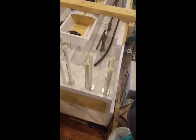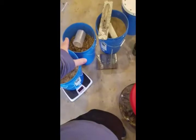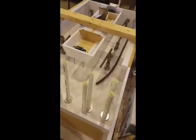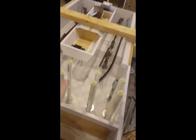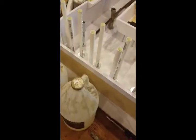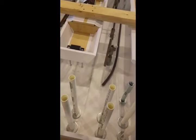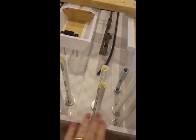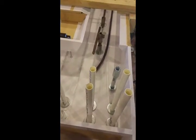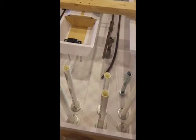This particular casting is 182 kilograms in total, based on how many of those small containers of gravel it will take to fill this particular mold. Now, I'm not filling this mold all the way to the top — there's a little divot in the middle where a ball screw rests. I've got some tapers on the side, some pipe that's going to displace some of the media, and some internal reinforcements and studs. But it's better to know what it would take to fill it entirely, so you have too much and don't run out halfway through your cast.